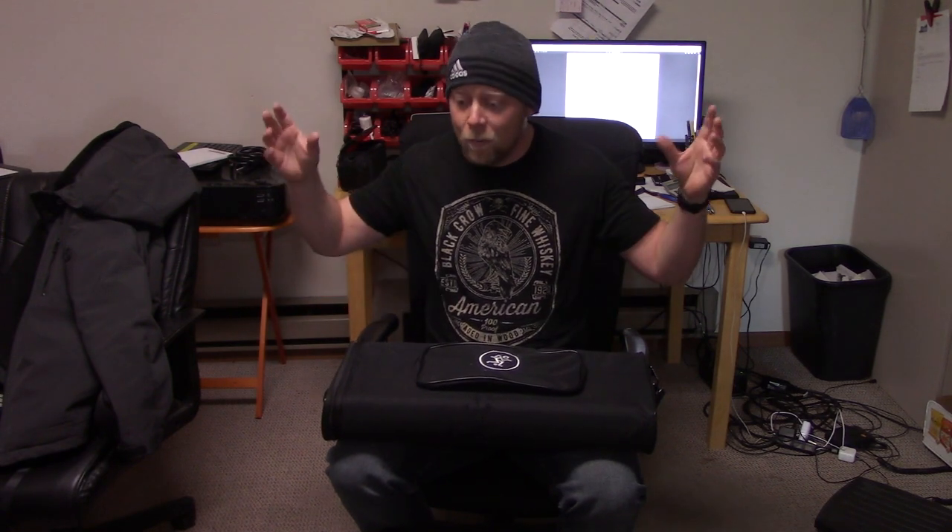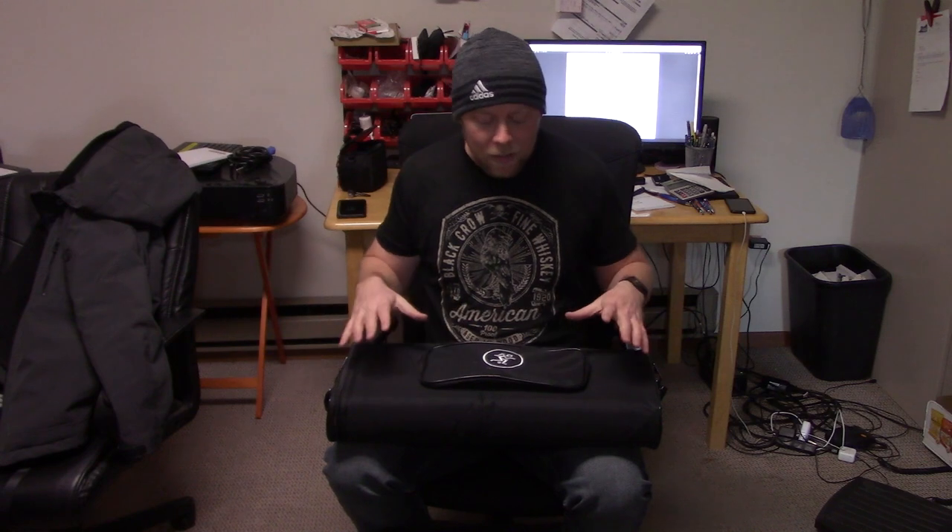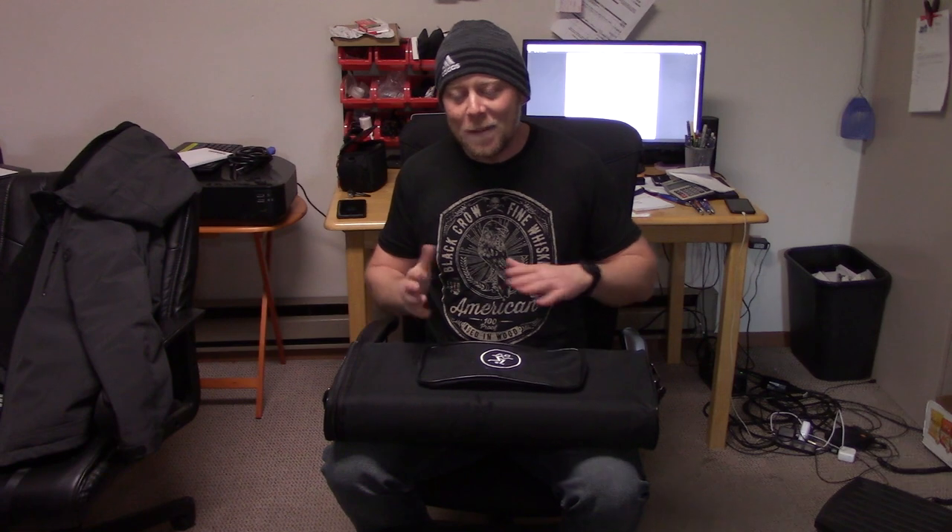So I'm turning over a new leaf. Unless you see me reviewing something like an HK Audio Element System or a K-Array System — something meant to be a line array you can scale in size — I'm just going to call them column speakers. A 10-inch in the bottom, six two-inch speakers in the top: this is essentially a 10-inch point source system. There's getting to be so many of these on the market, so I'm going to compare it to a column speaker equivalent. And I'm going to stop complaining about dispersion too — they all do it, you get what you get.